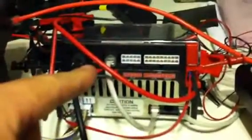The red cable that's going into the laptop's ethernet port is the ethernet crossover that plugs into the side of the SmartSiren keypad. And that's how you PC program it. And here's the back of the SmartSiren. That's got a crossover cable or some sort of link between the serial ports up top and serial ports at the bottom. Best I can tell from reading the manual, the control protocol between the SmartSiren 3000 and the Vision SLR is RS-485.